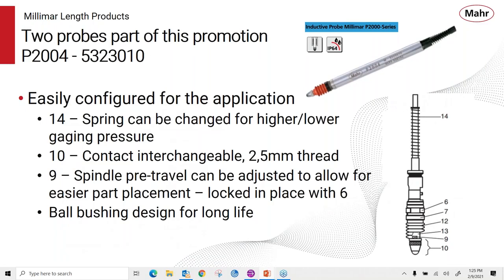And the probe can be configured for different applications. This is basically the bearing part of the probe, which can be unscrewed. And you'll see that there is a spring. The springs are interchangeable. So if you need lighter or heavier gauging forces, you can change the spring and accommodate for that. It uses a 2.5 millimeter thread contact. So all the DIN style contacts that Mahr offers can be screwed in there. If you need a bigger ball or a bigger radius or a knife edge or whatever, we can accommodate those